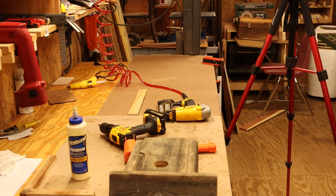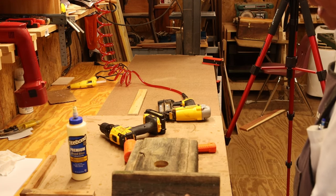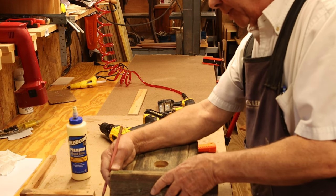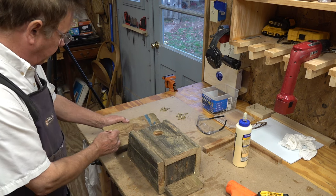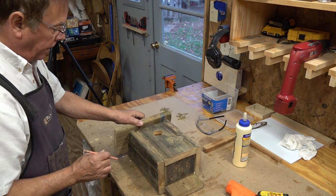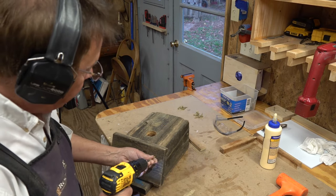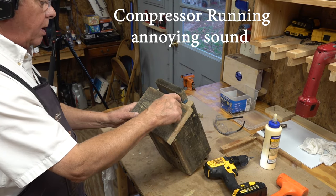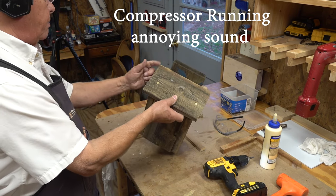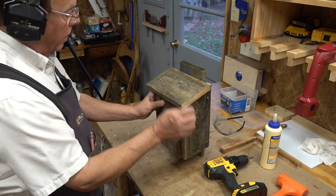I didn't find any adequate wood in my spare junk pile for a top, so I'm just going to use the same board here. It doesn't have quite enough overhang, but it's certainly fine — it's adequate. We're talking about a bluebird house. I like to give it about one inch overhang on each side, so we'll measure and cut a little bit off, then attach it. I'm going to put a bead of caulk right here just to keep rainwater from flooding right down. Usually I would bevel this edge, but we don't have enough length here, so I just put a little bead of caulk at the top.